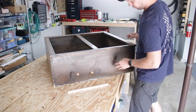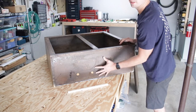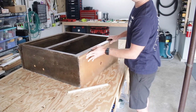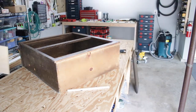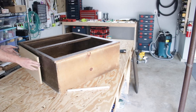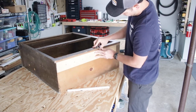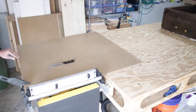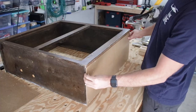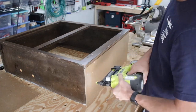Because of the way cabinets are manufactured and assembled, sometimes they have edges that overhang. Since I'm going to wrap the entire section to make the cabinet deeper, I need to fill in with blocking so I can attach it and make it flush. Here I'm making sure I have the right thickness of board for the blocking, cutting some scrap material into the right widths and lengths, doing a test fit, and then nailing it in with the nail gun.